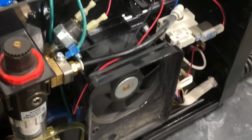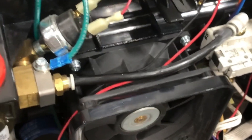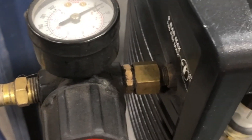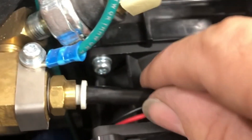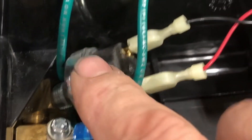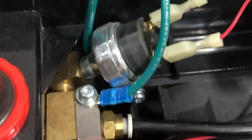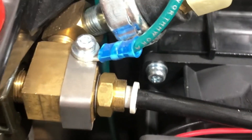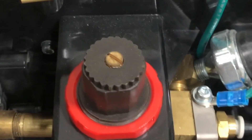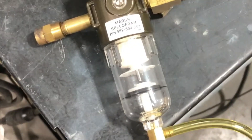I disconnected the air since the leak was getting a bit annoying. I'm going to take it apart and see if I can clean it up without having to replace anything. The first thing I'm going to do is take my air regulator off the backside here — pretty straightforward. I'll take this air line out, disconnect this sensor — I believe it's an air pressure sensor just to tell the unit that air is connected. There's also a ground to disconnect. Then I'll take the fittings apart at each location, take this red lock nut off, and I should be able to lift the filter unit right out.